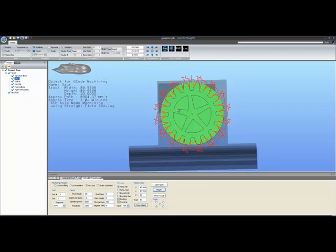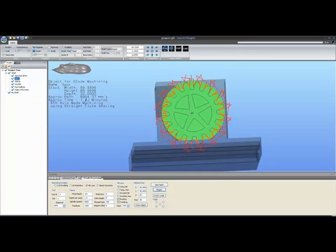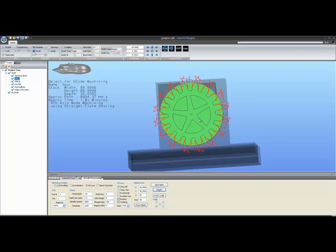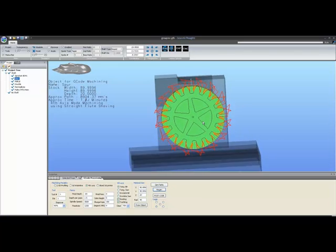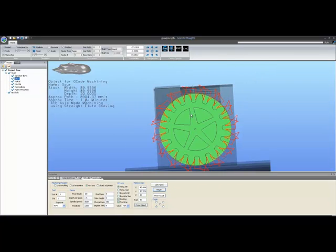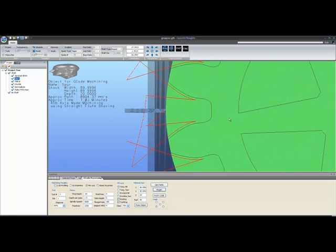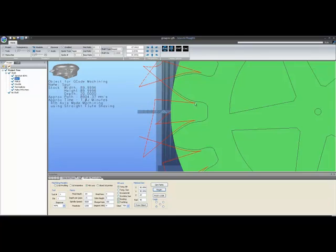So for my display, I've taken the liberty of taking the toolpath and rotating it around the disk instead of simply assuming that the disk will rotate into the toolpath. So in other words, the graphics are not really a visual representation of where your tool is going. That should be obvious because you cannot have a tool in a typical system coming in from the bottom and so on. This leads to strange arcs on the screen and such, so that if you, for example, take a look at this start waveform, this is the start cut for this tooth.